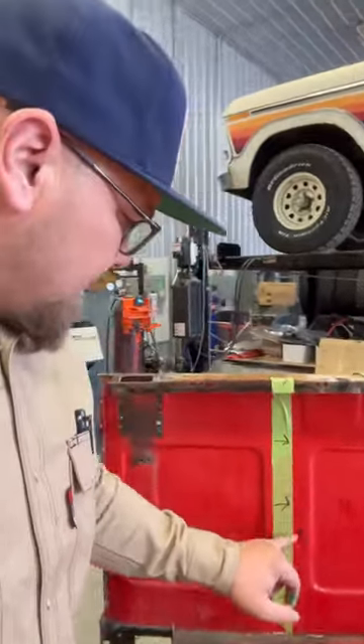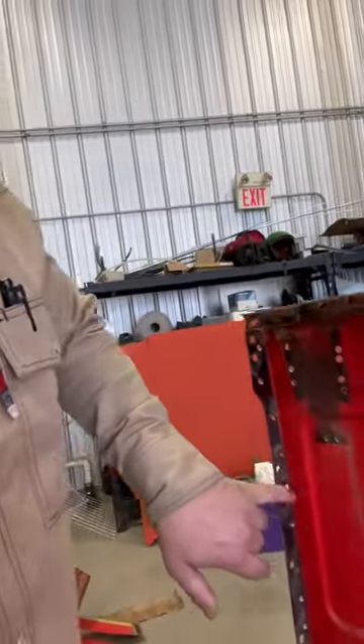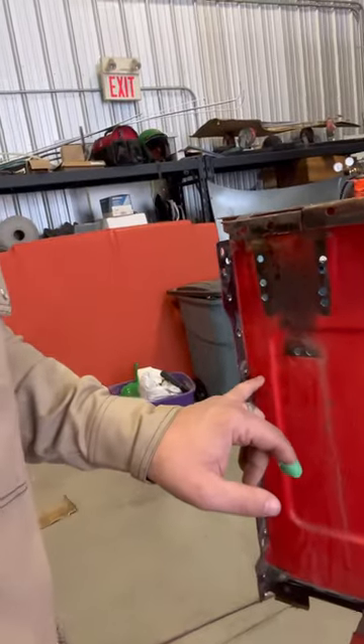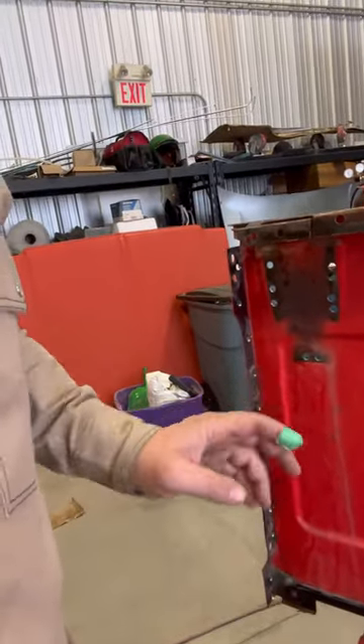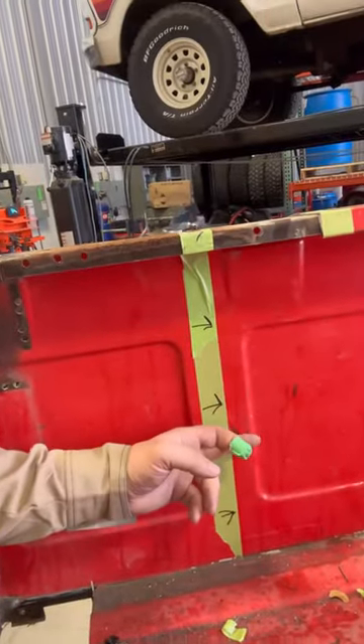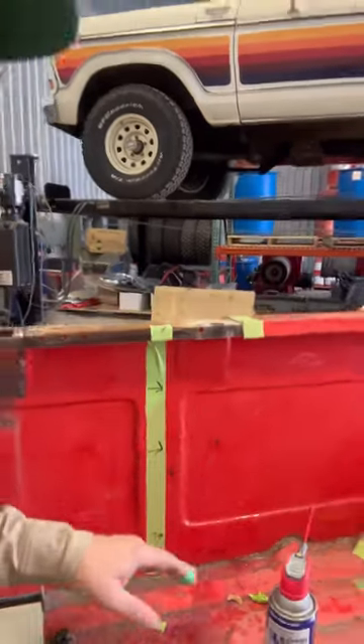In order to maintain a nice clean line here, I'm going to get this thing off and we're going to work some magic. We're going to cut this off down here on this line and I'm going to take this special tool I have that will create a bend in that where it can slip in behind this piece, and then I can tack weld it on there just so this looks clean.